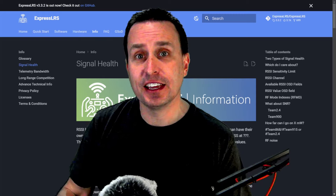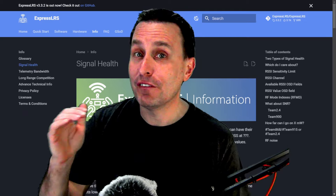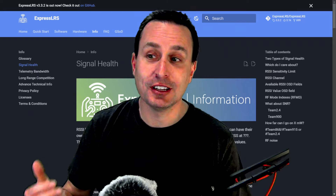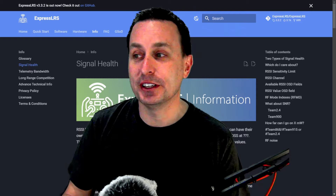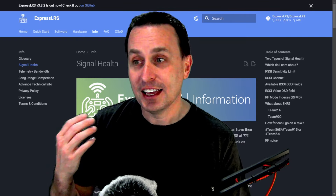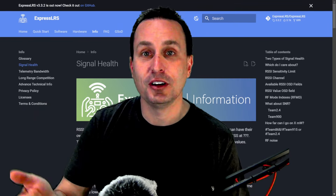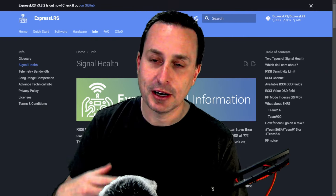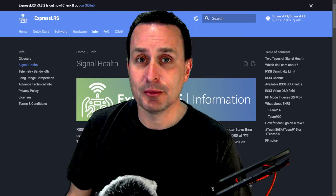For a concise setup, those are really the two main ones you need: the transmitter power level as your precursor — 'hey, I'm getting farther out' — and then the received quality indicator, which can drop off fairly quickly. Once you're at the highest power level you know you're already in potential jeopardy, and hopefully flying more cautiously. Setting the quality indicator threshold higher gives you a bit more advance warning before fail safe, though it can drop off rapidly.